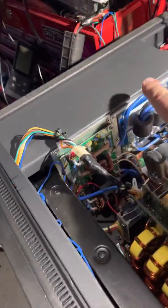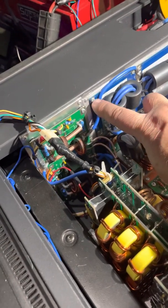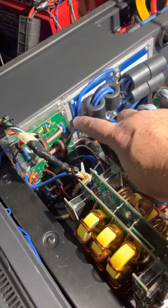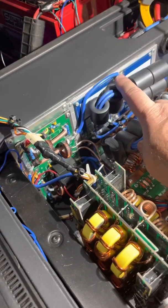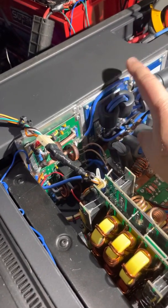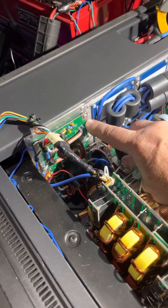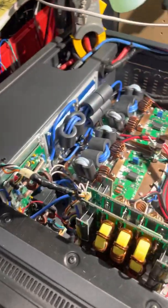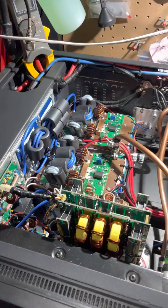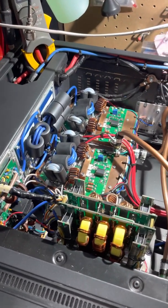I've also done a little bit of work with the coax length coming from the splitter and going to the antenna match board. I've still got a little bit more fiddling to do, because when I'm in the 7 MHz filter I'm reducing a bit more power than I should be. So generally you just play with the length of this — I might make it a little bit longer with a loop in it. 20 meters is absolutely on fire, and 40 lags a little, not much, but I want to try and level it out.